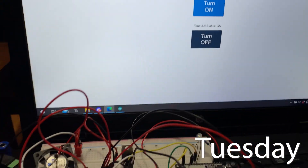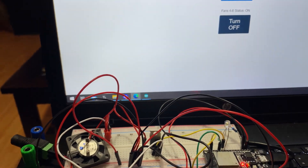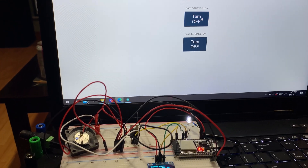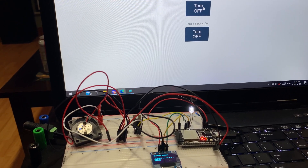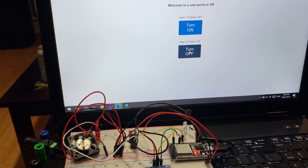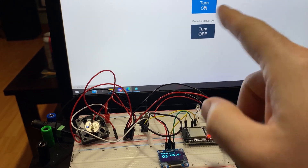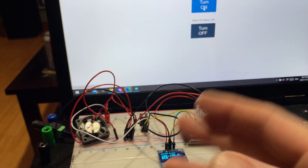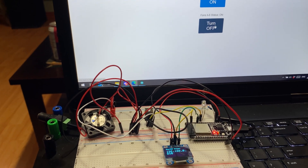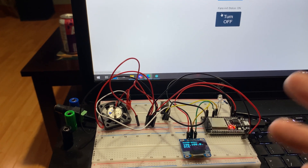Back at the scent VR project again tonight - predominantly the updates are in the code, but this is online on my Wi-Fi. If I turn bank one on and off via the web page, our fans are now MOSFET controlled and working perfectly. I have two banks of three, and the web page just controls them. Right now it's just tied to bank one on and off, but they'll be automatically randomized within them depending on which bank you have active.